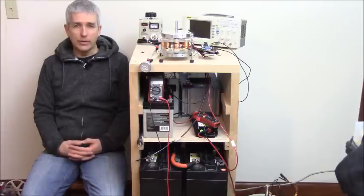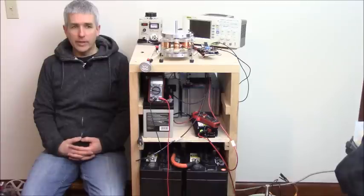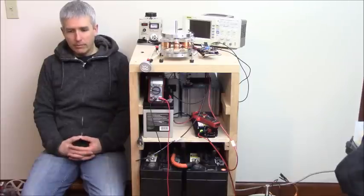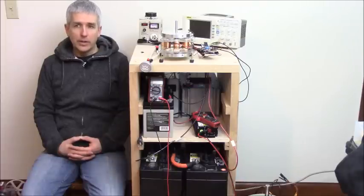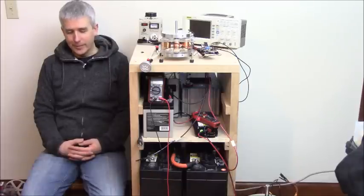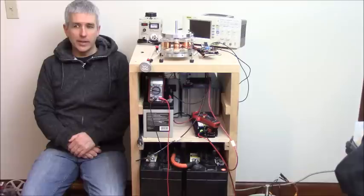You can sit at 14 volts, and they just have a higher voltage range. It really changes the battery quite a bit, so you have to get used to that. But anyway, they will be pretty good. They can start sulfating too, obviously, in the same way, so you have to use them more than I do. Those particular batteries, I forget about, they get stored away in a box, and then it's like, oh no, I should have been charging them. But anyway, the point is that they can go down really low in voltage a lot quicker than the other batteries. The other batteries are not going to dive below 11-some volts even when they're really discharged, because they just sit at that voltage.